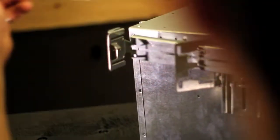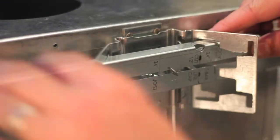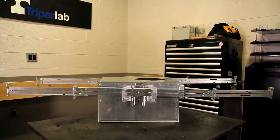To further increase the span to 48 inches, add a fourth L-bar to the opposite end in a similar manner. Final adjustment and locking remains fully functional within the primary pair of assembled L-bars. Vertical strength remains at 48-inch extension.